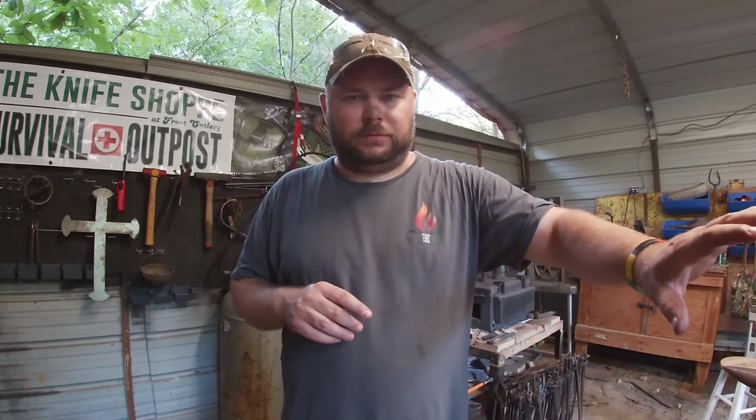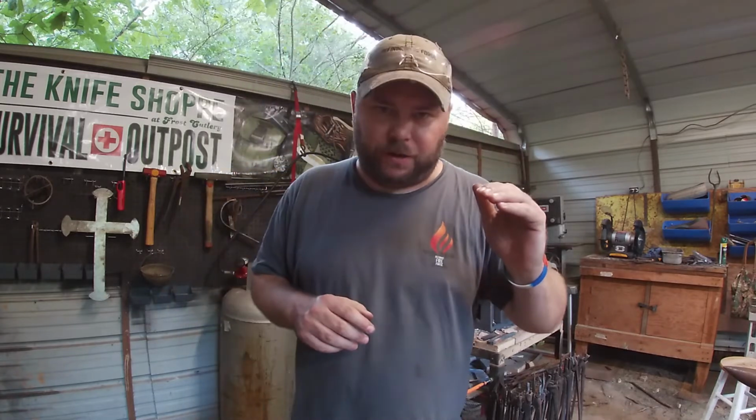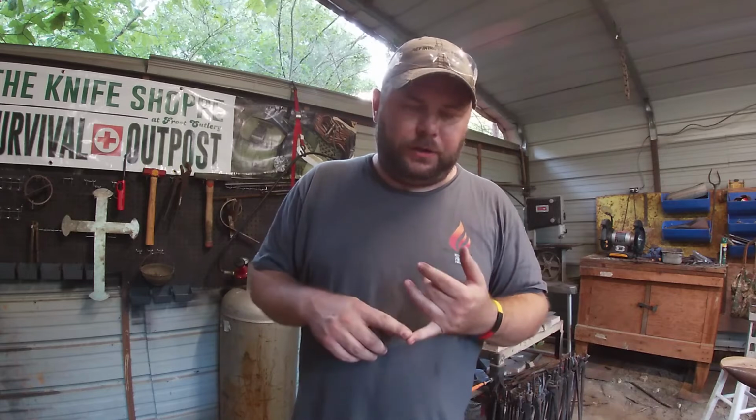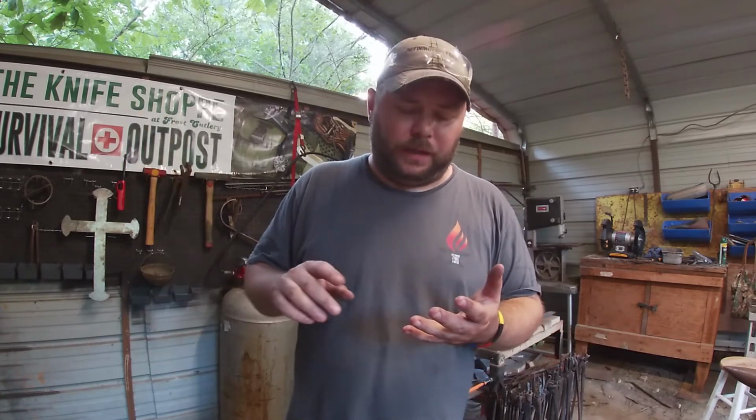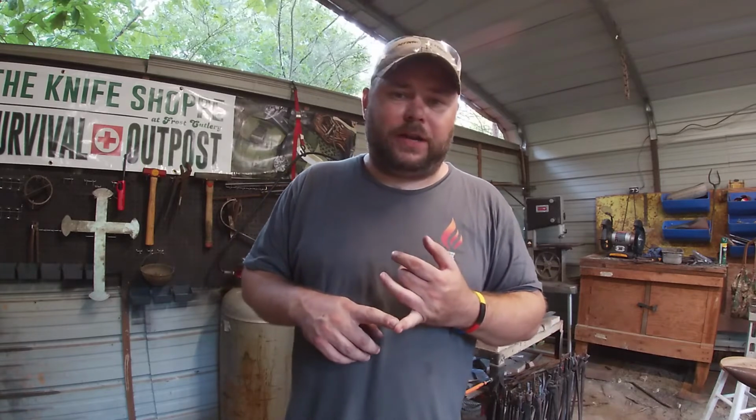But you're going to heat your oven up. Don't put it in while it's preheating, or your blade won't heat treat right. Once your oven is up to temperature, I can't tell you what temperature it is because I don't know your oven. If your oven's gas versus electric, that will affect it. My oven is an electric oven. It's a Samsung, I think. I don't remember. I put it at 435 degrees and it does what it needs to do.